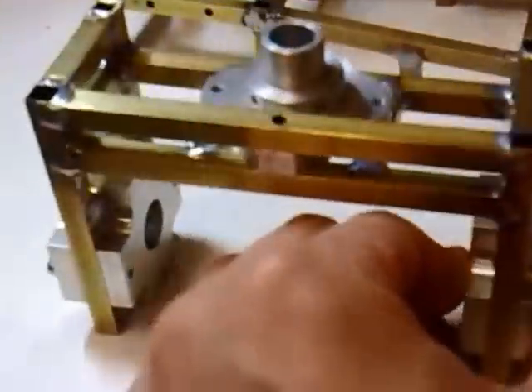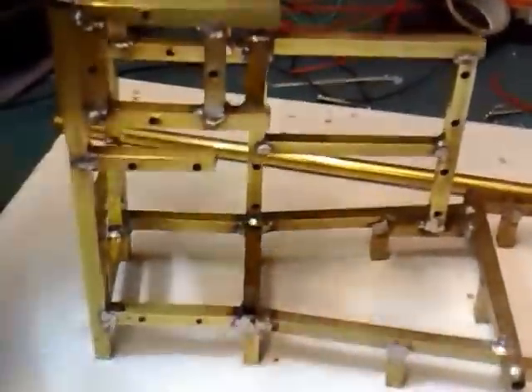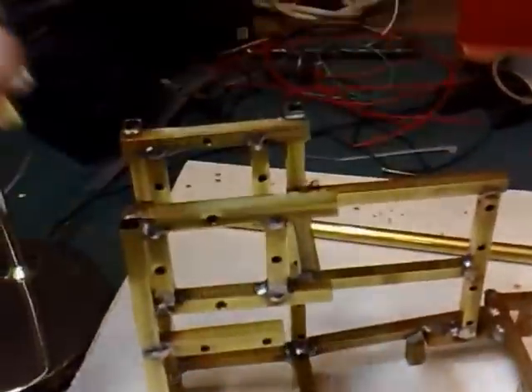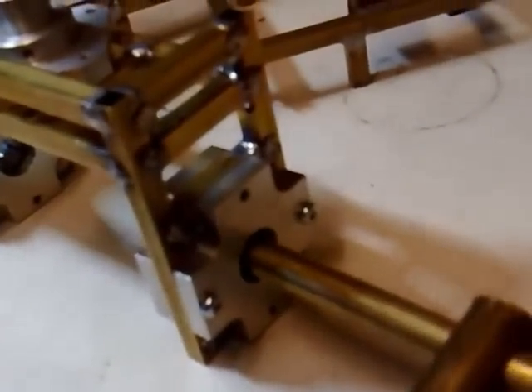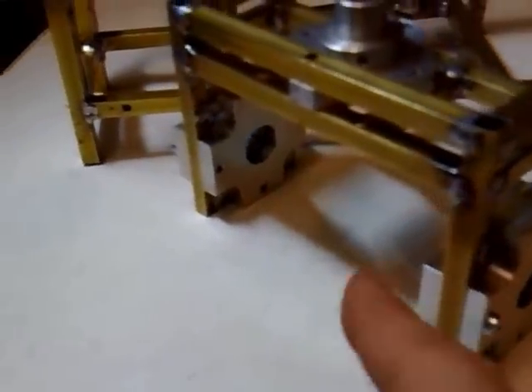This shows the main bearing housing now complete on this side. Now I've got both sides. This will form part of a humanoid robotic foot prototype. And when I'm ready, this section will go in the center there, and I shall tap this brass tubing through the center of the bearing there.